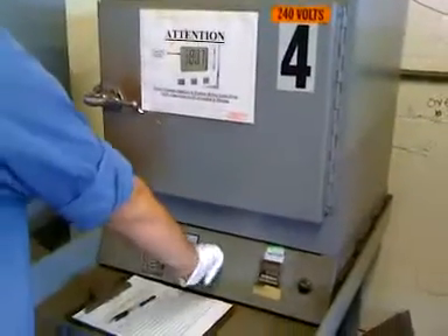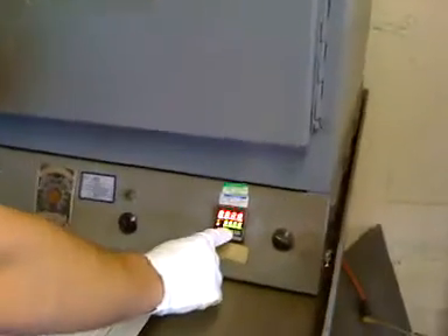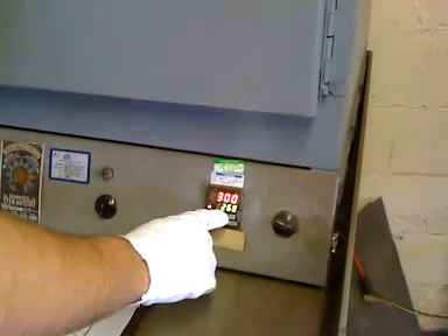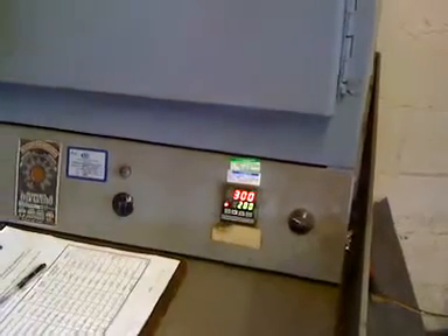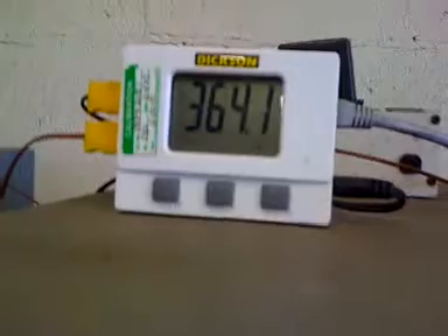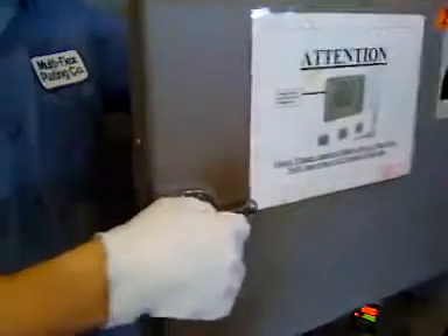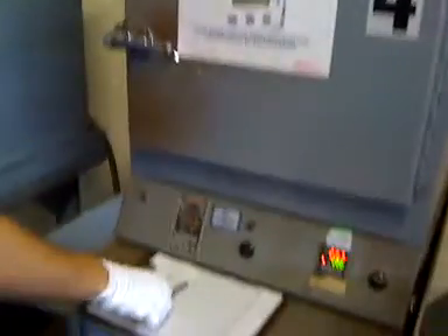Here's our oven. The first step is to turn the oven on and wait for the dial to go through its ramp up so you can adjust your temperature. According to our spec, we dry the coupons for a minimum of 30 minutes at 200 degrees. You want to check to make sure that the data is logging — this device controls two ovens. There's a note on the door showing exactly what to look for, and of course you have to record all of your data.